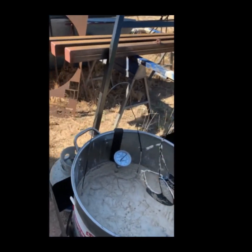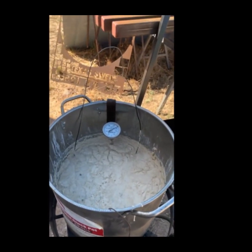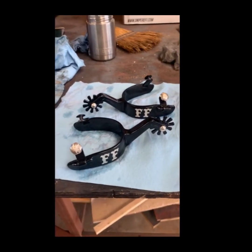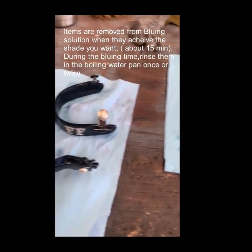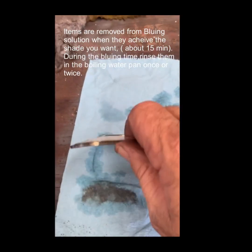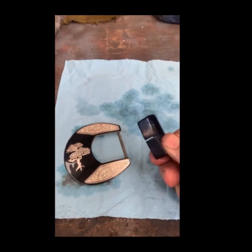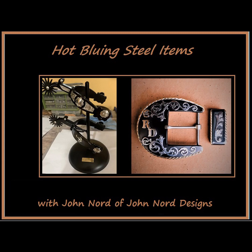Here's the buckle — I've got it on a hanger also and the hanger sticks well up out of the salt. I raise it up and check it after about five minutes just to see that they're turning colors. Typically we want to boil them for about 15 minutes, but that depends on the shade you want — 15 minutes has been good for me. I rinse them a couple of times during the boiling process: I take them out on the hanger, dip them in that clean pot of water, and put them back into the salts. I do that during that 15-minute period. After you get these blued you might want to wax them with Renaissance wax.